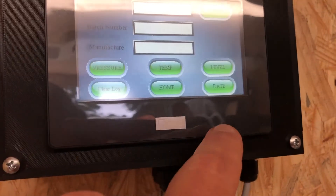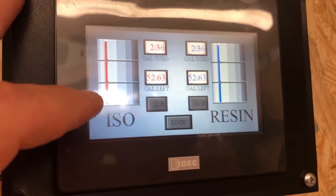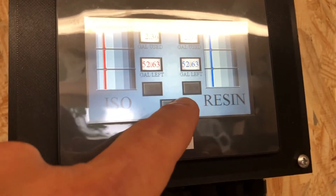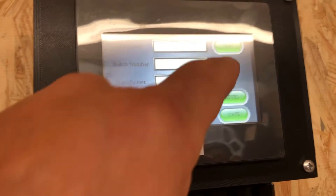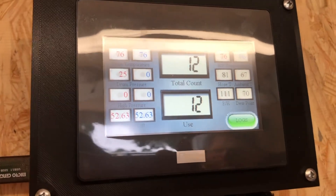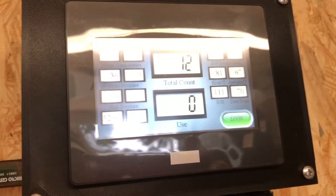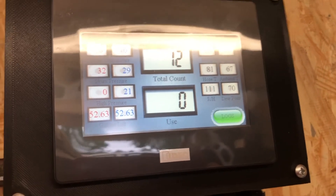You can keep all of this on this thumb drive — bring it into your computer and plug it in under the customer's name. The material in the drums will go down as you use it. You program how much material you've got in your drums. Graco makes a couple of very nice sticks that tell you how many gallons are left in your drums. You can save all this. It tells you how many strokes — you can count the entire day or reset it. If you want to figure out how many strokes or gallons you use in a room, it will data track all of that for you. It doesn't run the machine — it just tracks everything this machine does.